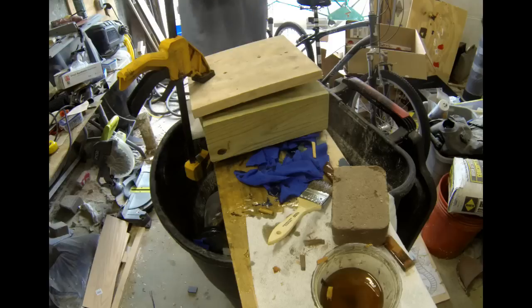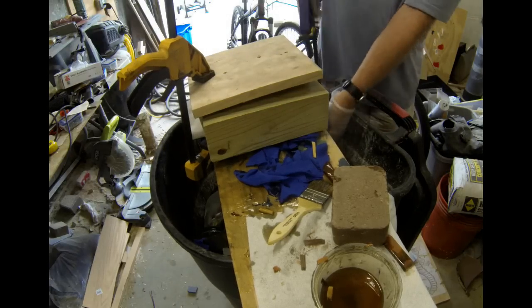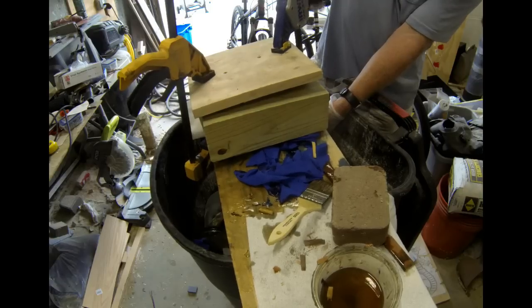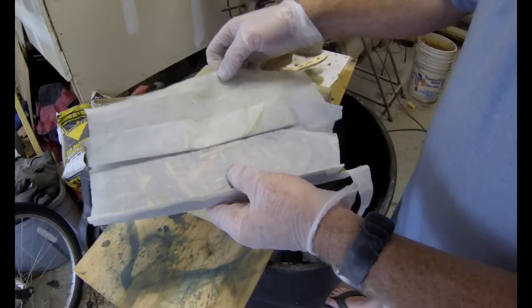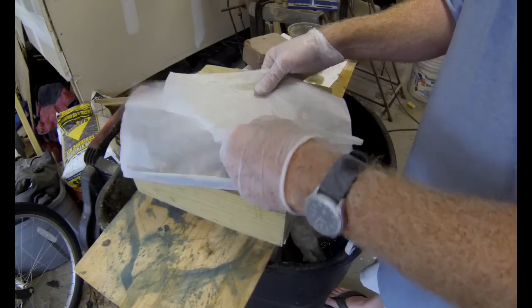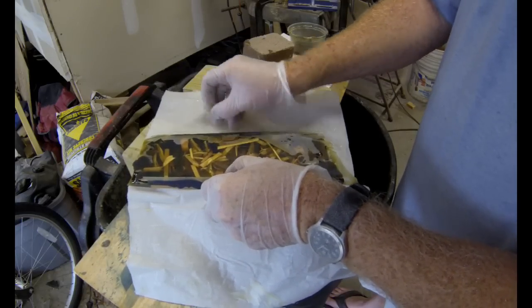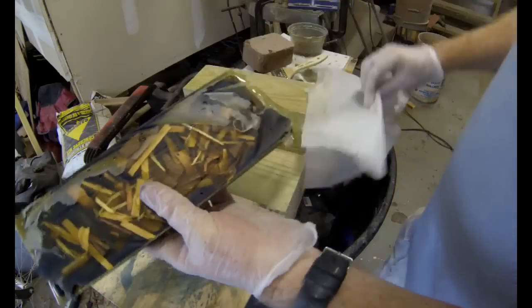It's a very easy cleanup. I use 4 clamps, and as I'm clamping it, I just look at each side to make sure that the spacing on the left is pretty close to the same as on the right. You want to end up with a fairly flat piece of micarta as the finished product. After it dries, you take it out of the press, unwrap the wax paper, and now you get a pretty good indication as to what the final product is going to look like.